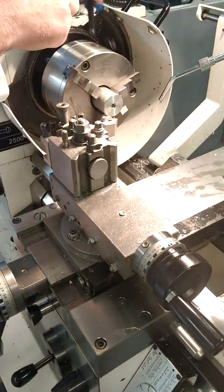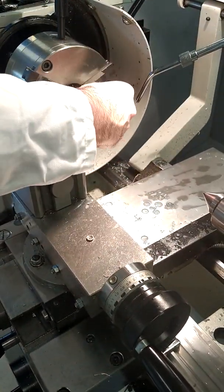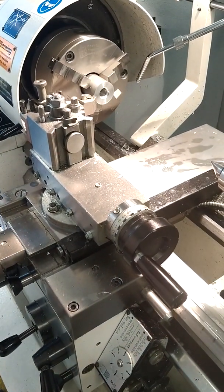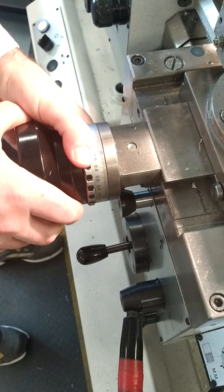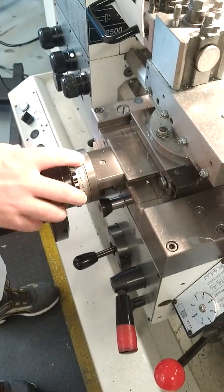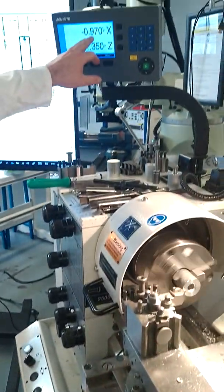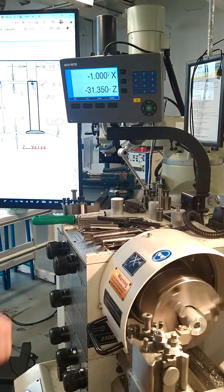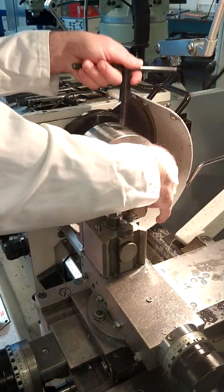So popping it around to the far side, and again applying a 1mm chamfer to the back end. So that's the first one done. And then on to the opposite side, the 1mm chamfer. So position it in position again. Press your tool off it. Zero your cross slide, and zero your DRO again, the reference point. So that's at 0, X to 0 again, powering the lathe on, and machining in again, 1, which is 1 above. Perfect. And then powering off, you have the chamfer applied, and that completes all the work on the lathe for now.